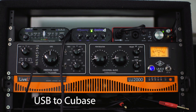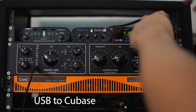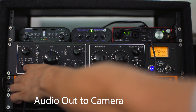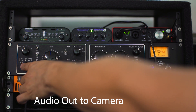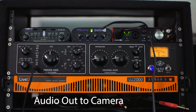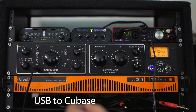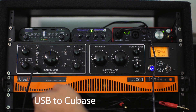So here are my basic settings. The gain, I've been leaving at zero. For the microphone — this Neumann TLM-103 — I did a lot of back and forth testing between 500 and 2K, and I've also read that this microphone uses 2K so I left it at that. For guitar, I use 4.7K and switch it to high Z and turn off the phantom power. I leave this pad on instead of negative 15. Polarity out is where I have it.